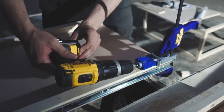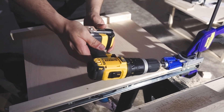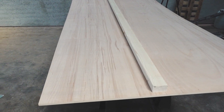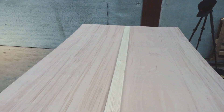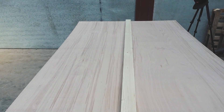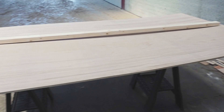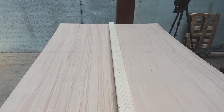Good time for the battery to die — you're kidding me! The next step in the bench-making process is to create the top base out of 12mm ply — very thick and very sturdy. We need to cut it exactly in half: it's 120 centimeters wide. We're going to clamp a perfectly straight piece of wood in the middle and then use the circular saw to cut all the way along. Fingers crossed it stays straight because we've only got one shot at this.